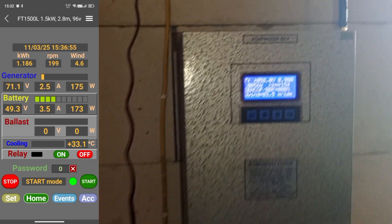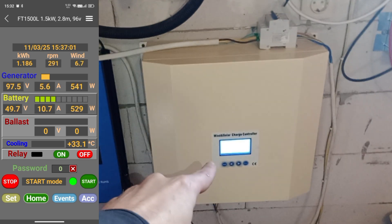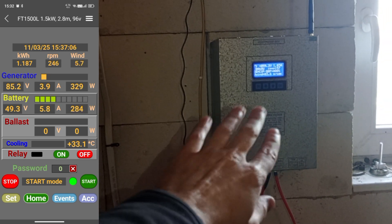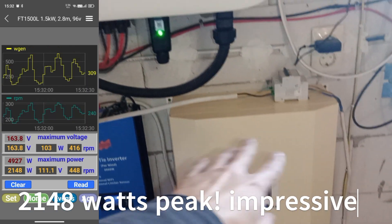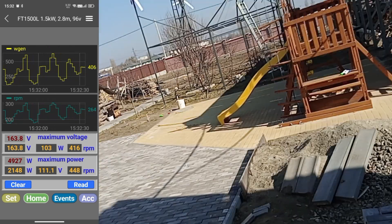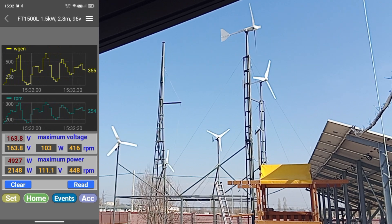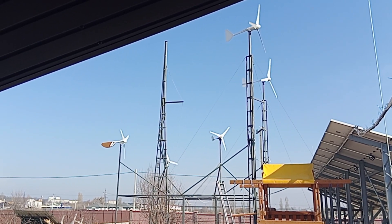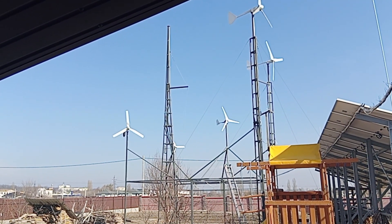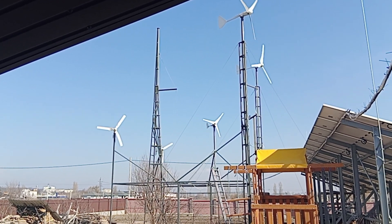In general: 48-volt turbines go for a 48-volt boost controller; 96 or 120-volt turbines go for a buck controller — whether it's locally made or an LHCM buck version. That's the main conclusion and the proof you have right now. Thanks guys. I still have a lot of stuff to do — the tower is still empty, cables to connect, and so on. Bye for now!